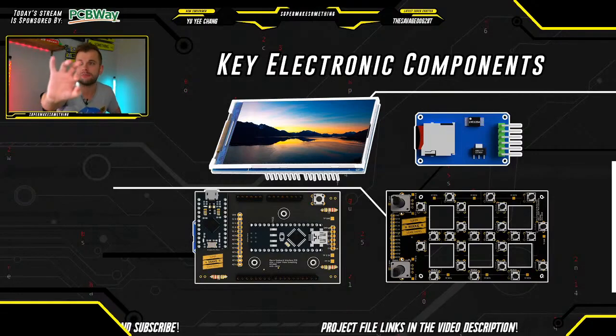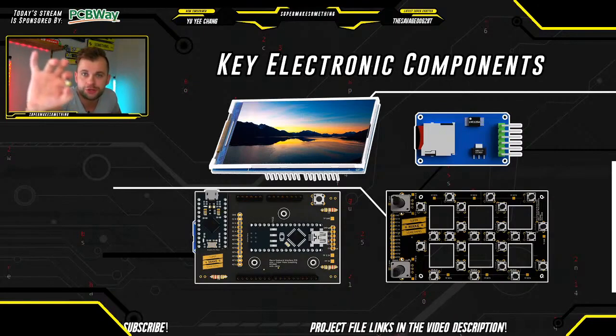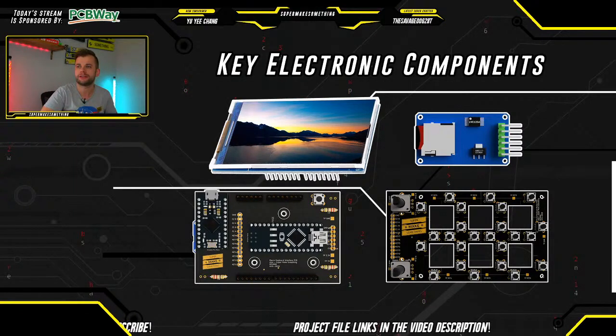And because of that, I've added the capability to integrate this rotary encoder into the Stream Deck, which you see on the button PCB there on the left-hand side. And again, these just rotate left and right. Basically, I will assign these to arrow keys within the Arduino code. But one advantage is that they also click.